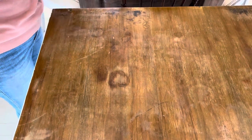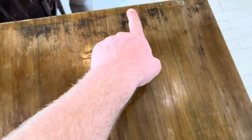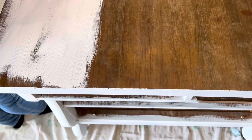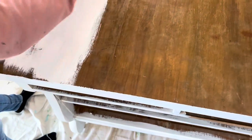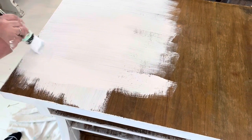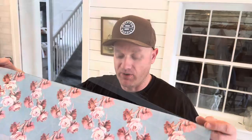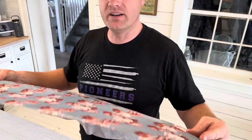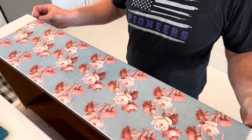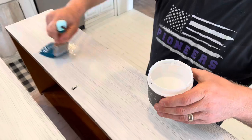I think this dresser's going to be pretty — I'm excited. Now that we've got all the glue and scraping off the top, it needs a complete new finish. We're going to put the Salvation Solution on here to stain-block because we're worried about some water spots and old stain. It might take two coats because there are some heavy-duty stains, but I think one should be fine. We've got the Cottage Floral JRV paper — it's 30 inches wide but a little narrow for this drawer, so we'll have to cut it. I'm going to put some liquid patina on — it's our favorite decoupage medium — giving it a healthy coating right over the top of the Salvation Solution. The white base is going to brighten up that paper really nice.